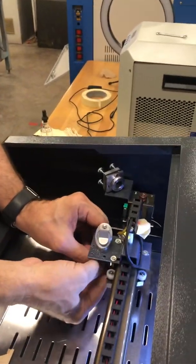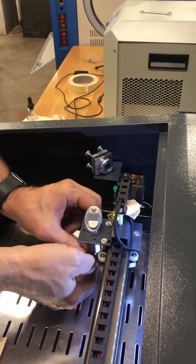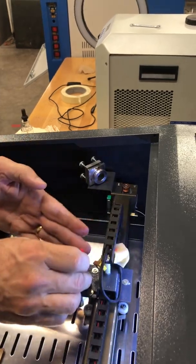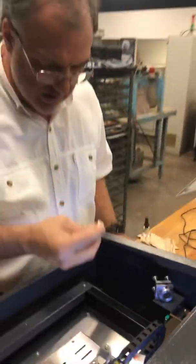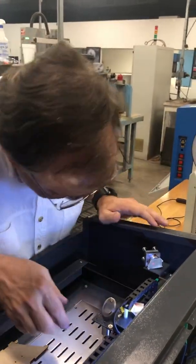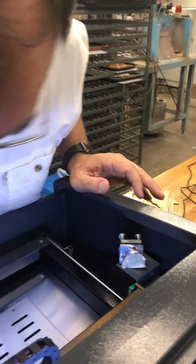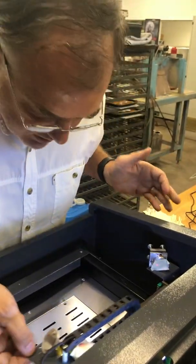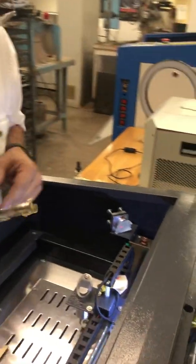So let's take a look at it. I screw my tool in here, and with that you have the beam that comes out. The first thing I'm going to do is take a piece of tape and put it on the first mirror. It's not really touching it. Let's take a look at how that looks. Not terrible — well, it actually isn't too good. You can see it walking over. Now, this head doesn't have any three-axis movement; it only rotates, so I have a pair of pliers.